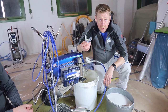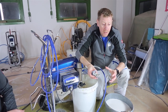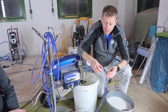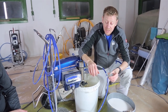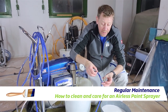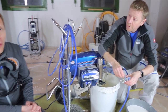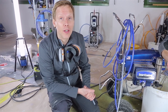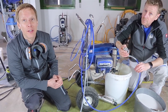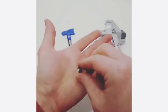We've used those for our tips quite a lot but we still have an issue with the guard. So what we've found is you can buy the actual fluid in bigger quantities in bigger bottles. We just get a nice little pot that's got a good sealant around it, drop these in, and use the same - because it's like a mini paint stripper. I never ever clean my tips and leave them out to dry. I always leave my tips in a solution. When I open the pot, I can put them straight in - the guard would just wipe clean, the tip would go in, and you just start spraying. There's no downtime. When you do that, take care of the seals, because often they vanish and people put the tip holders back on having forgotten about the seals, then wonder why the gun and the tips are gripping.